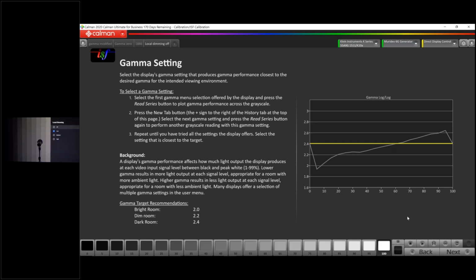So in other words, if I turn the backlight up, the color of the screen shouldn't change. It should just get brighter, right? So the fact that the grayscale is changing between off and low and the local dimming's kind of weird. But we're not going to leave it off anyway, because we know it does no justice for the black levels for dynamic range. So let's go from low to medium. And back in August when we did this the first time, low to medium made a really nice change.